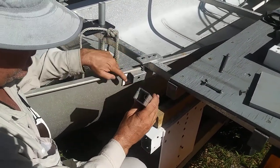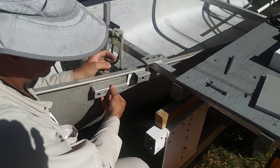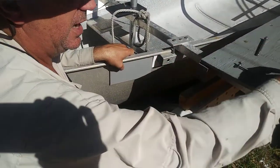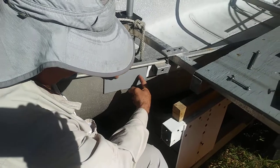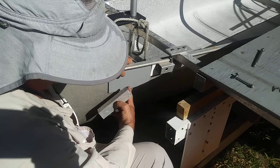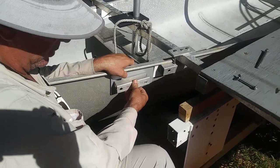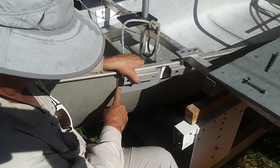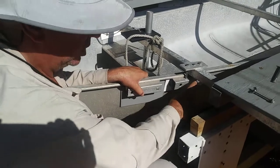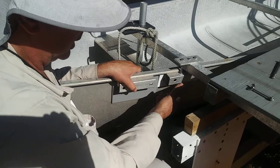The end caps are not on yet. It's drilled here, so you get this plate and you put that under here. You'll then take the small screws and put them outside here and here, and maybe even underneath if you want to add. What that does is it makes a compression point where it involves more of the side wall and divides the load — the shock load when you hit something or a wave action happens — it divides that load.